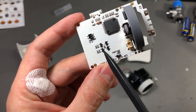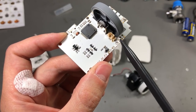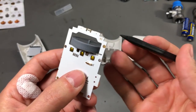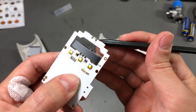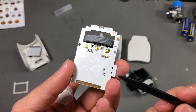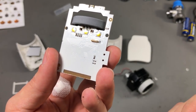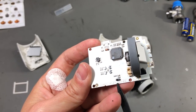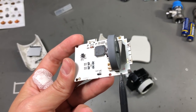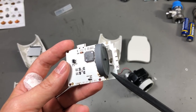Here is the H-bridge, which is made with discrete transistors, and that goes to the motor which uses a JST connector — very nice to find in such a cheap product. On this side we have the small thermistor with some cutouts to maybe isolate it from heat generated on the PCB. We have three tactile switches and the crystal oscillator for the microcontroller. We also find a model number for this product: Comet SCFJ. And we have a bunch of test points, probably used for in-circuit programming and testing of this board.